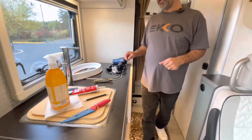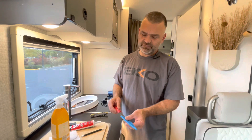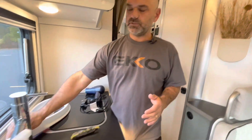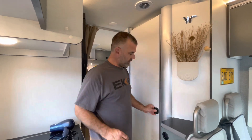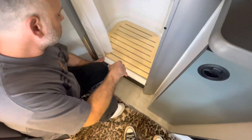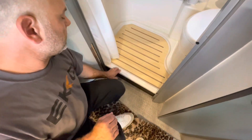Here are the basic tools you'll need: a sharp blade - you can use an exacto knife; I pre-tested scissors but wasn't happy with the cut, it wasn't super straight. You'll also want a mild cleaner or denatured alcohol to prep the surface of the acrylic curb - it needs to be free of soap scum, extra silicone from the factory, and anything else on there. You can also scuff it with 150, 180, or 220 sandpaper to give it a better surface to bite on.